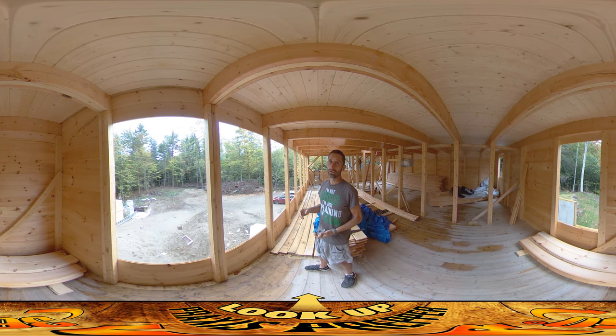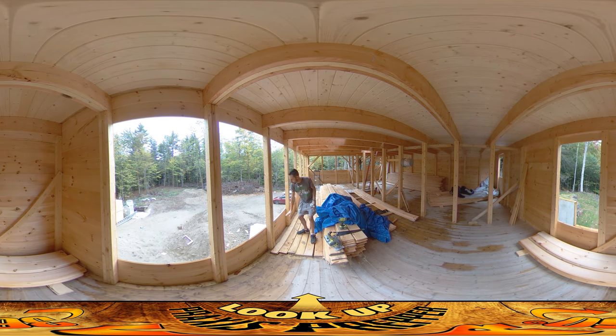The rough opening for the windows is five feet five and a half inches for these large windows here. I've decided to have them about 22 inches off the floor, which puts the top at about 87 and a half inches up. I'm using a saw to cut open exactly where they're going to be. I kind of roughly had the opening for the windows here — I didn't completely board it up — but the windows are a little bit larger than these holes are.